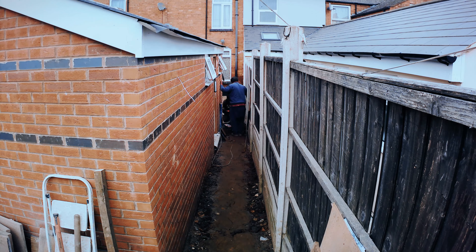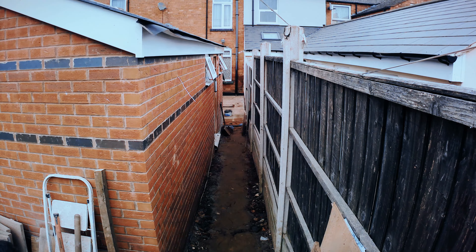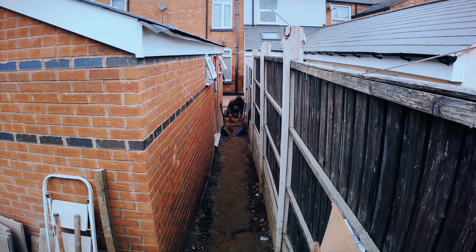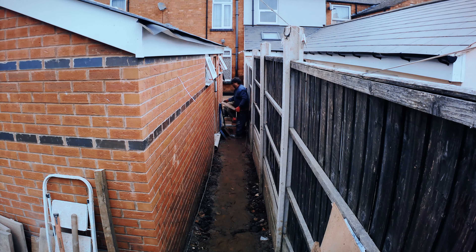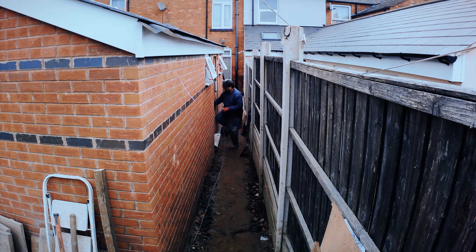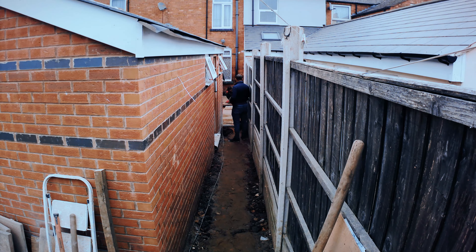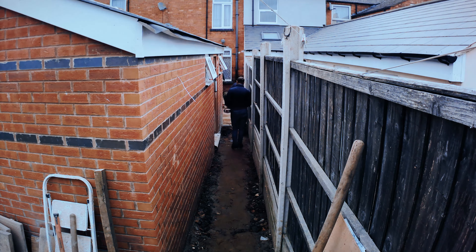If you're not already following this series you can see how my extension went. For damp and finding how to stop damp on your house walls: the main issue is water from the ground puddles in a specific location, butts up against your wall, the wall sucks up that water, and over time because the bricks are so wet and they're breathing with hot and cold air — if you have cavity walls they condense — that creates the ideal environment for mold.